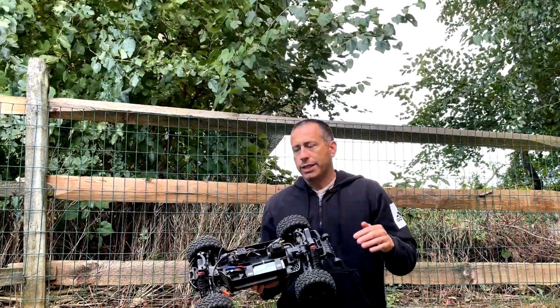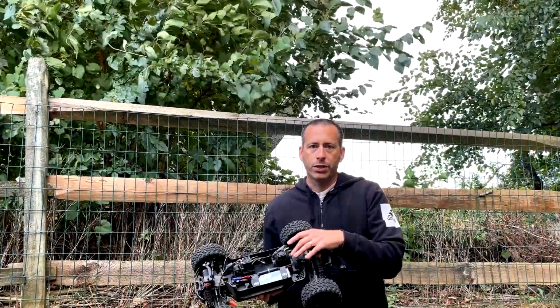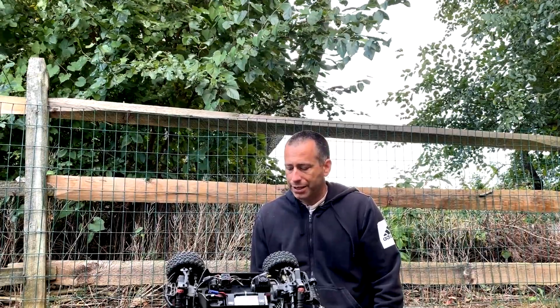So whereas the SMC and Sypom may be able to go close to 3.4 volts, these others are closer to 3.8 volts. So all that capacity that could be utilized between 3.4 and 3.8 volts, give or take, isn't there. It's not usable. So a battery like this might only have about 2,000 milliamp hours of usable capacity, whereas the Sypom and the SMC may have, say, 4,000 milliamp hours of usable capacity.